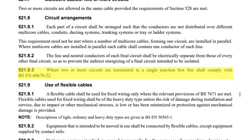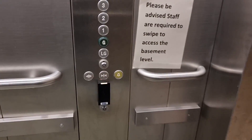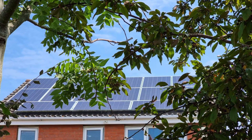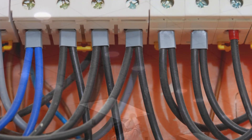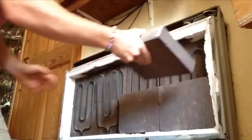This particular standard also recognises other boxes and enclosures. Also, let's not forget the need for multiple supplies within a single accessory or enclosure is seen countless times within industry. There are many examples which require multiple circuits within a single enclosure or accessory, such as lift control panels requiring a three-phase and single-phase supply fed by two separate protective devices at the distribution board. Three-phase, single-phase and 110V supplies in workshops all housed together. Alternative sources of supplies at a distribution board, i.e. PV systems or generator sets. Three-phase contactors with a separate circuit feeding the coil. Lighting in a large commercial office balanced across phases controlled by a three-gang grid switch. Storage heaters with E7 and 24-hour supply, and so on.